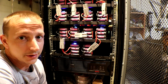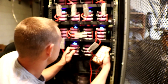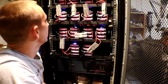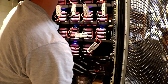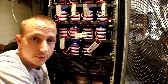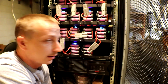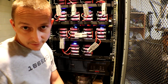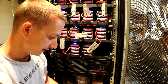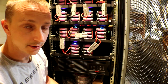Not looking too good — I'm guessing it probably got too low. Right now it's at 45.5V, and the average I'm seeing is around 3.3V per pack. I could just turn it on and see where it shuts off. If it shuts off at 42 volts — that's 42 divided by 14 — that's 3 volts per cell.